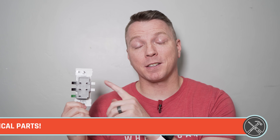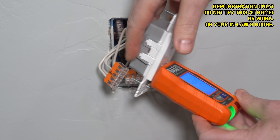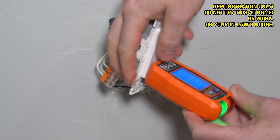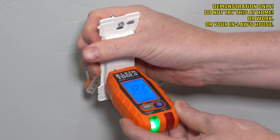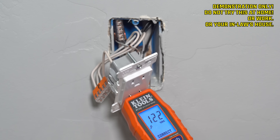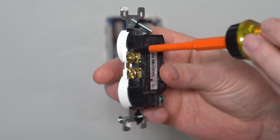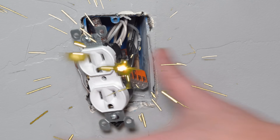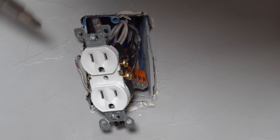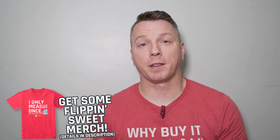The result of these cleverly colored levers is that there are literally zero exposed metal conductive parts anywhere on this outlet. Everything is completely covered up. I just wanted to show that this completely live outlet with electricity flowing through it — I can actually wrap my hand all the way around it because there is nothing exposed, and that means I'm at way less risk of receiving any sort of electrical shock. A traditional outlet, on the other hand, has exposed electrical areas that you can touch with your fingers, with ground wires in the junction box, with other outlets, with your screwdriver, or even against a metal junction box itself. These are all risks and failure points that are completely avoided with the Decora Edge system.